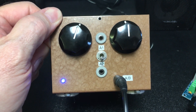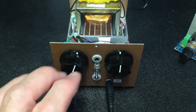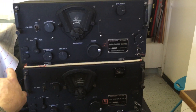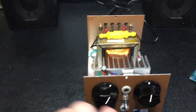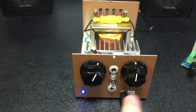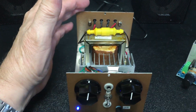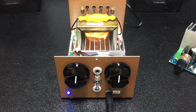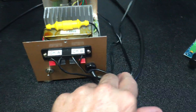It says channel A, A1, A2. Well, that's so that we can use only this channel instead of that channel to do testing — A and B testing of different sources of equipment. For instance, over here I have these two surplus radios, BC348s. Take both outputs and you plug them right into the inputs here, and you can switch them back and forth. What you're doing is using the same audio chain — mainly the A channel — to switch back and forth into a common speaker. That way you get a good A and B relationship in how the audio sounds coming over these shortwave radios. We have a little speaker terminal strip, channel A, channel B, an on and off switch, and power cord right here.